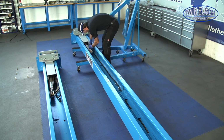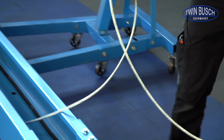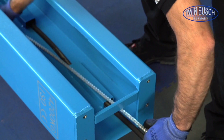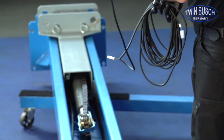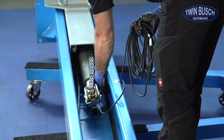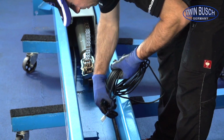Now you can remove the steel cables from the bottom part of the post. The cable can now be placed loosely through the post. Now we can lay the cable for the Y connection to the electromagnets. Both connectors can now be placed through the holes at the bottom of the posts laid upwards with the hydraulic hose.